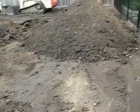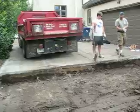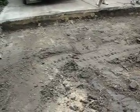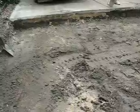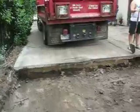So we're adding pavers in this section, and we'll have 12 inches of class 5 base under there. Our driveway will still be flexible, so even if it does heave a little bit with freeze and thaw, it just goes right back to where it was. Pavers obviously don't crack as they're flexible.